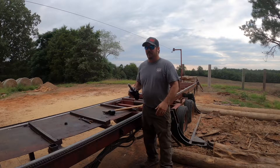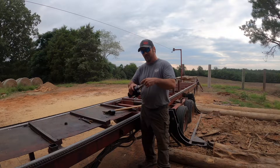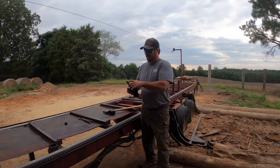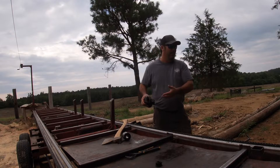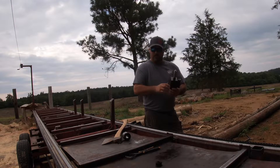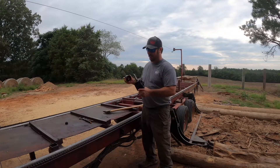We didn't have a valve going through COVID right now, so I done a little bush fix — I just did a little welding right here on the end. I knew it would probably distort that plunger, and it did, but what it did is it enabled us to get another order out that we needed to do. Our guide wouldn't move back and forth otherwise. Bush fixes are just temporary, and that's what this was.